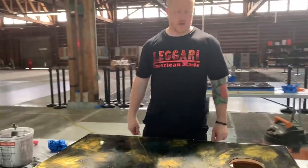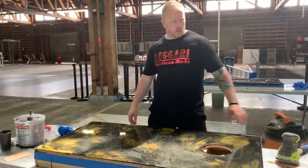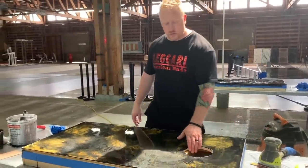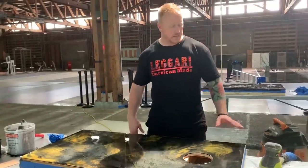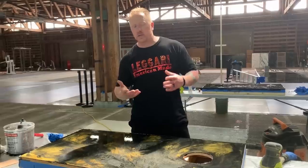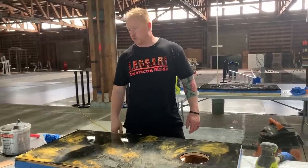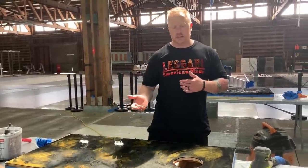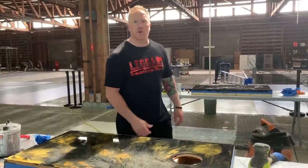For cornhole that's not good — you're going to reach in the hole to grab a bag and cut your hand. So we're going to take some 220 on a palm sander and just soften those edges a little bit, maybe round them just a little bit. Even doing them by hand is kind of risky because they are so sharp. But before we put the urethane on top, which is the next step, we really need to get our profile done.